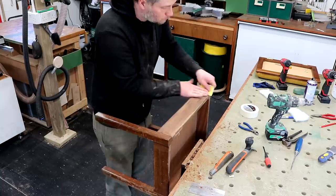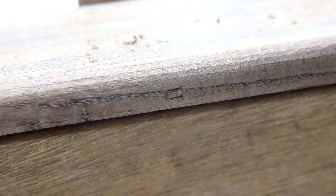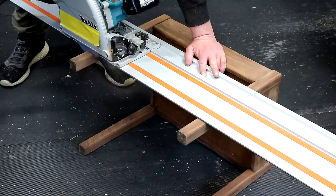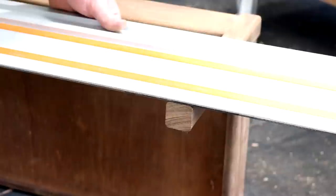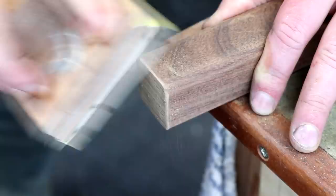So this is the part of the project that I really didn't feel too good about. I wanted to lower the height of the stool because it was designed for sitting on rather than resting feet. In a way it seemed like a real shame to do this but we really have no use for a piano stool. I used the track saw, lining it up with my marks and making plunge cuts through the legs. And whenever I do this it usually results in having to spend some time carefully leveling the legs so there's no wobble, but not this time — it was fine. I eased over the edges with some sandpaper just to help prevent the grain from tearing out if anyone drags this around the floor.